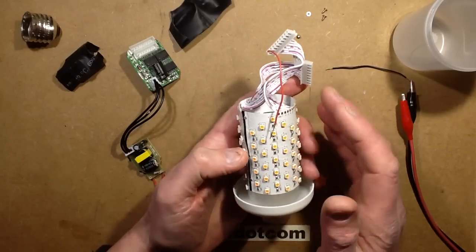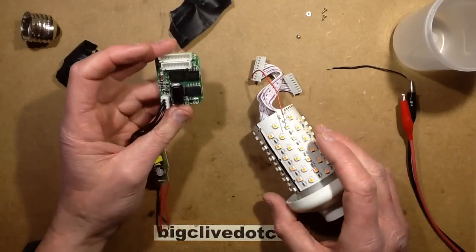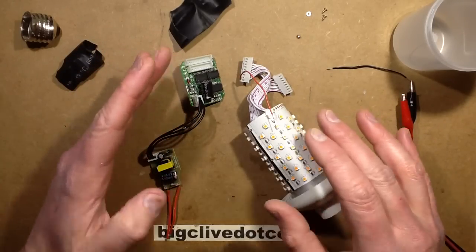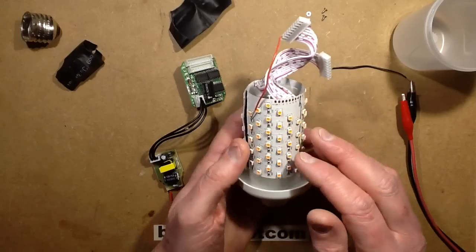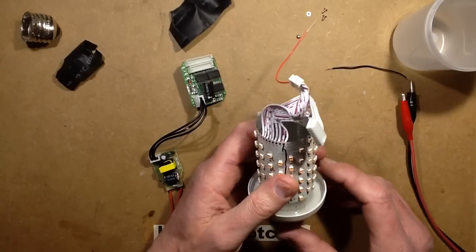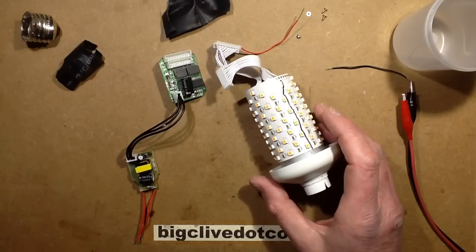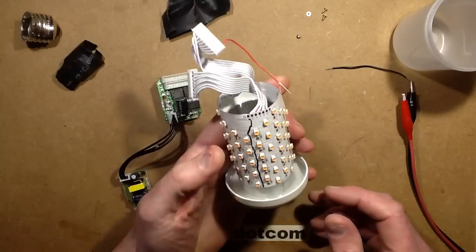My temptation would be to write in the software what's called a linear feedback shift register, which uses basically a stream of bits along a couple of bytes, then backfeeds using an XOR logic gate into the input of that stream. It creates huge random sequences — millions of bits long — and that would be nice for triggering patterns so that the flame just never repeated visibly. It would always just be randomly doing flamey things. But this is very impressive. Definitely check out the link down below in the description — it will take you to the manufacturer's website. The lamps are very impressive, and you'll see other demonstration videos there and their factory with a whole row of them being tested. This is definitely a worthy toy.